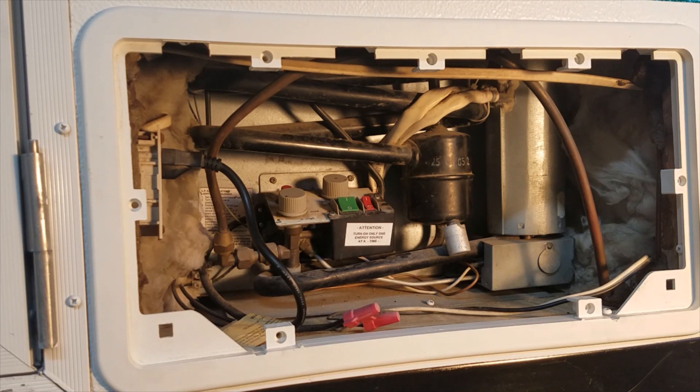This is a very simple system — there's no circuit boards really. It's mainly just power to the switch to a heating element. We're going to show you now how to test for voltage, and if you have voltage, how to go ahead and replace the heating element.